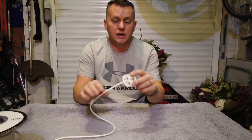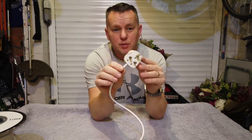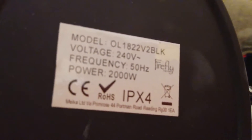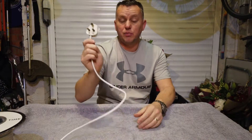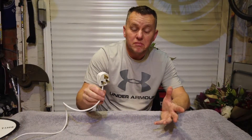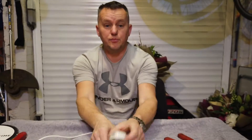Let's have a chat about fuses — the fuse inside the plug is very important. To find out what fuse you need, divide how many watts your appliance is by 240. To know the wattage, just look at the label on the back of the appliance. For example, a 2000-watt kettle divided by 240 is 8.3 amps. We don't make an 8.3-amp fuse, and there will be surges when you plug it in, so you put a 13-amp fuse in. For something small like a TV, 3 amps is going to be absolutely ample.